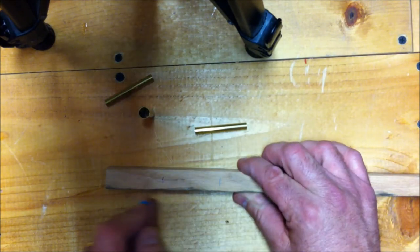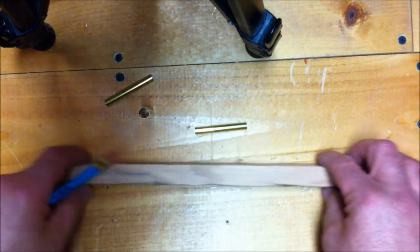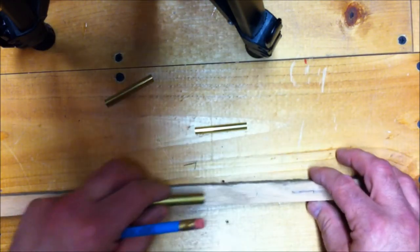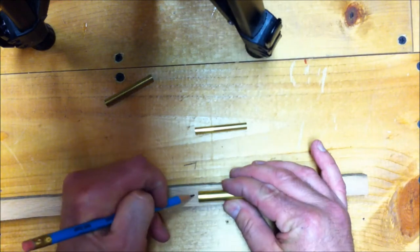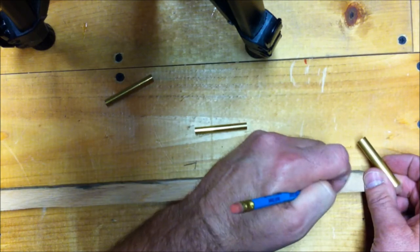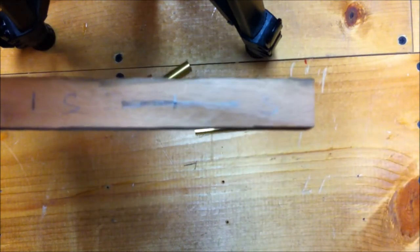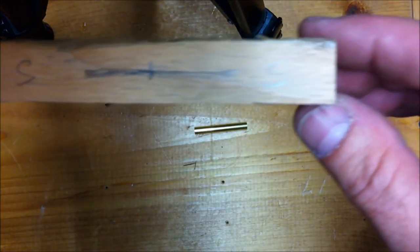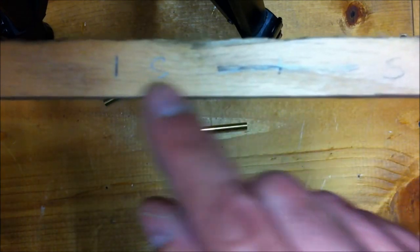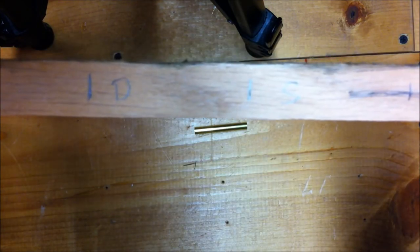So there are the two pieces for Sally's. I'm going to turn this around — I'm left-handed, it's a little easier for me. I'm going to draw a perpendicular line right here, and the idea is so that I can match the grain back up on her pen. For Don's pen, I'll flip this around and mark Don's blank. I'll put a D on his and an S on Sally's blanks to keep them together. The perpendicular line allows me to keep the grain together, and here's Don's blank.